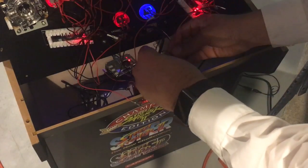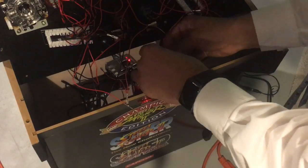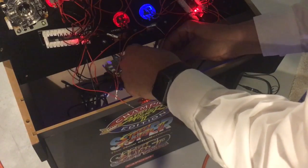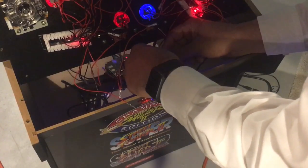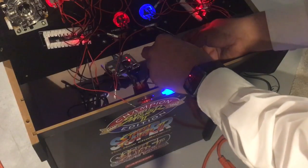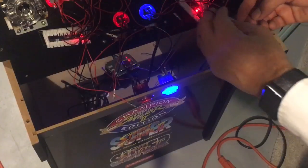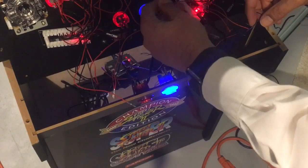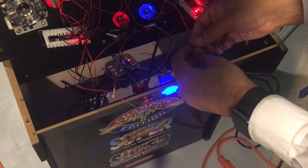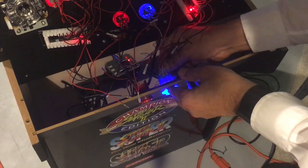What's happening there is the line to the LED has like 2 extra button slots, and those, the black and the red, are just loose. They're not plugged into anything, and if they touch anything metal or touch each other, it'll cause these buttons to blink. So what I'm going to do at the end of this, once I connect these 2 buttons the same way I did before, connect the LED line, power line, and connect the controls lines, I am going to use some of the tape I have on hand to tape up those ends so that all this Christmas tree blinking stuff goes away. So that is what you're going to see right now after these 2 buttons are set up.